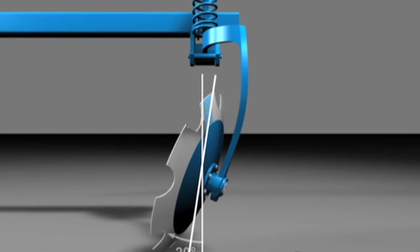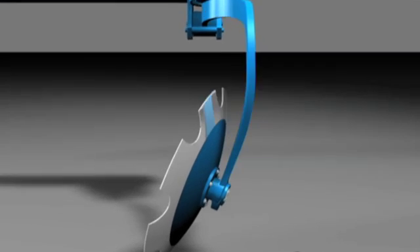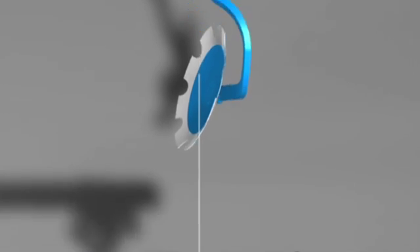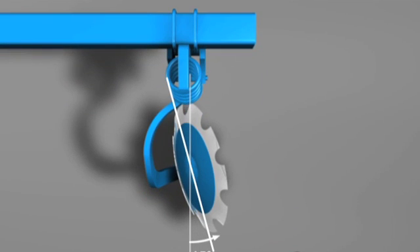Firstly, the angled position of 20 degrees ensures the disc cuts the soil optimally. And secondly, the front row of discs with a 17 degree cutting angle and the back row with a cutting angle of 15 degrees are turned slightly out of alignment to the direction of the cultivator in order to improve incorporation.